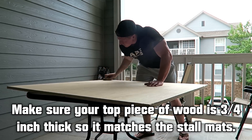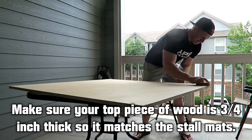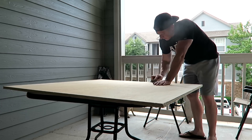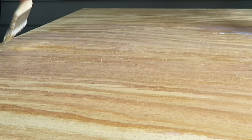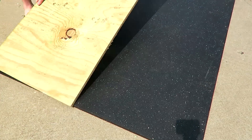The top layer is what you can see me sanding down here — you could get oak, maple, or birch, but those cost a little more. For $15, a sheet of four-by-four pine worked great. To give it some protection we coated it with polyurethane, and while that first coat was drying it was time to work on the side pieces.